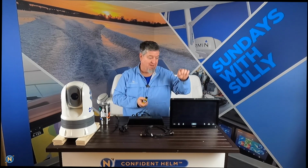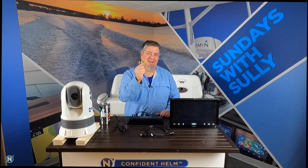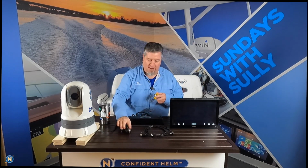You need a yellow PoE blocker. If you are putting anything into the Garmin network and it doesn't say Garmin or a Garmin company, anything like that, you better have a yellow PoE blocker set up on there. You can use this coupler after that if you got to make a longer run or you need to do a bulkhead fitting or anything like that. You can use that for this. Not a problem. But you better have one of these in here.